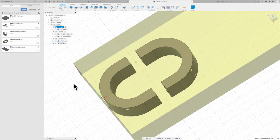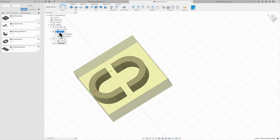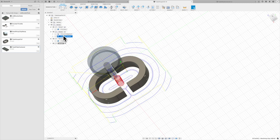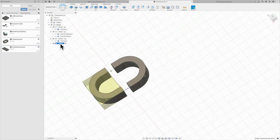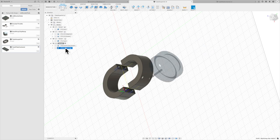Got into the first setup and you can see I had a pretty large piece of aluminum that I started with. So I just set it up to face that off, and after that was faced, then I cut the block in the bandsaw, got to a shorter piece, went in there with some adaptive roughing and adaptive pocket clearing to clean those up, and then ultimately flipped that over, got rid of some of our excess material by facing that off the bottom, and then went in there with our setup to get these drilled and tapped. So set that up on the end, drilled those, and again did some rigid tapping to just get those started nice and straight and square, and then ended up finishing those off by hand in the vise.